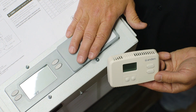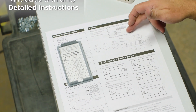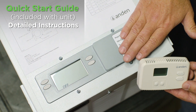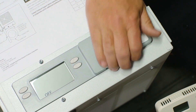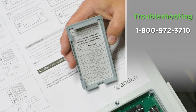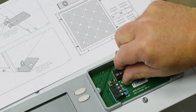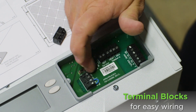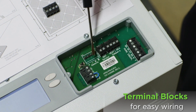I'm going to show you today how to hook these two together. Once we wire them together, we have to get into the installer setup menu to tell the unit that this control is attached to it — we've got this in the quick start manual as well, including the wiring diagram and setup menu steps. Underneath this cover are the wiring terminals. The most important thing: 1-800-972-3710 — if you have any questions, call us. These wiring terminals pull off to make it easy to connect wires. We're going to use this unit as a remote, so we'll use this set of terminals labeled remote, with plus, minus, A, and B.